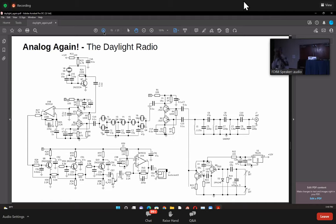If you look at this shielding, it's made out of really thin copper sheets that you get in the market. I think they're used in transformers. I'm not sure what they use it for, but in India, you get this from the copper shops. I've built a casing for the VFO also with that. The VFO casing is required for two purposes. One, of course, is that you isolate it thermally so that the heat coming in from the PA does not get in there. Second, it's shielded electrically from the bandpass filter, which is right behind it.